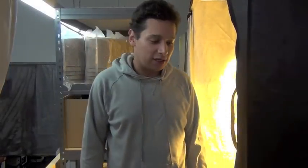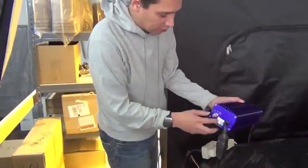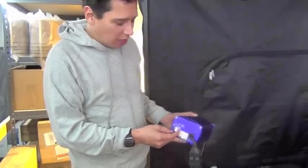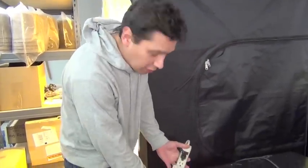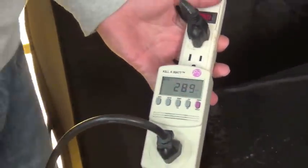Now we're going to compare with a 400-watt leading brand HPS — this is a brand new ballast. Since we're comparing with a 300-watt plasma, we've dropped it down to 275 watts to be somewhat in the ballpark. We've let it warm up for about a half hour and are drawing a total of 288 to 289 watts.